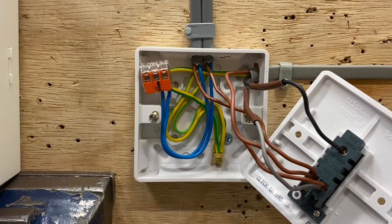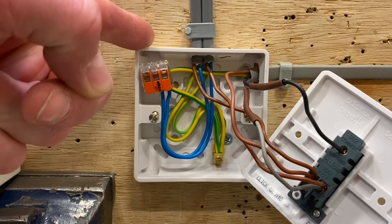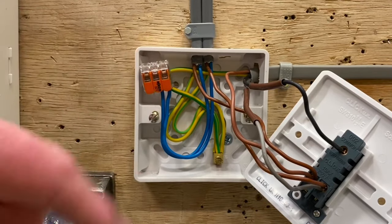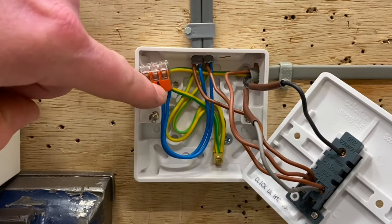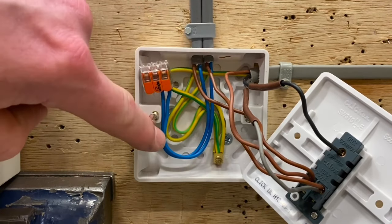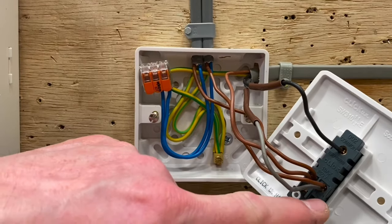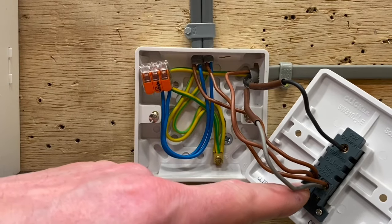Let's have a quick recap at switch number one. In the first video this was our one-way switch, and we converted it in our second video to two-way. This switch will not be affected by what we're going to do now. Our supply comes down bringing in our permanent line and neutral, which goes into a wago connector. We've got our switching line and neutral going out, and we take the two brown conductors — permanent line and switching line — into either L1 or L2. It doesn't matter which way around they go.